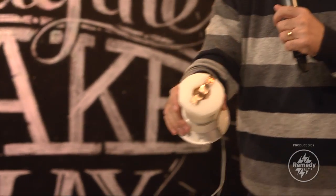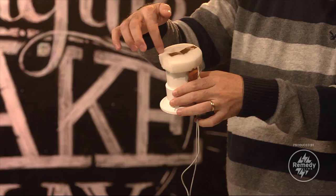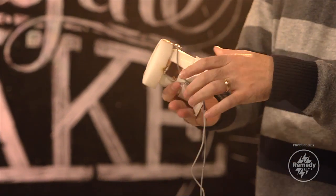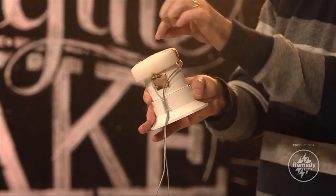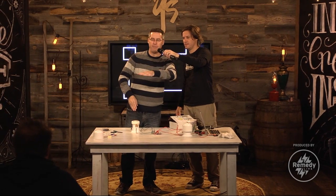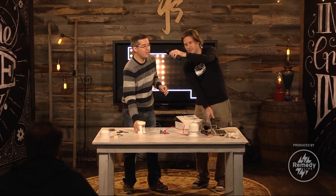So that's the base part. Inside, I took a piece of foam — we tried magnets and springs, but the foam piece works fantastic. You cut it into a circle, cut the middle out to make a little foam donut. Inside, I have a piece of copper going across the bottom of the PVC pipe end cap, a piece of foam on top of that, and another piece of copper across the top. You can get copper sheets at Hobby Lobby for about $2. Cut it into strips with scissors and hot glue everything together. Now whenever you press it down, the two copper pieces touch, close the circuit, and send the signal to the Makey Makey.